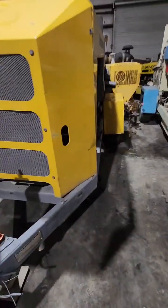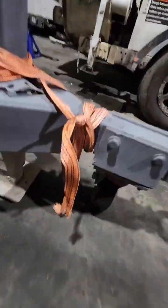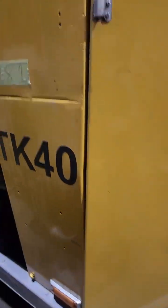We'll make sure the lights are working and that they are the exact correct ones. Here's the serial number 3781. We're going to be removing this leg attachment they put on and replacing it. We'll put the safety stickers in, and I will replace the hydraulic coil. This part here is frozen, so we'll have to rebuild this right here.